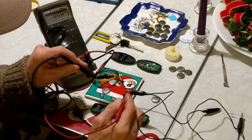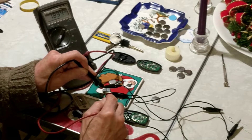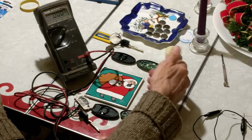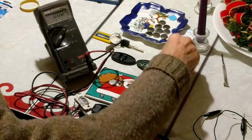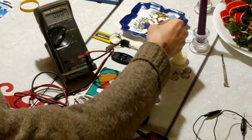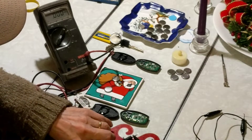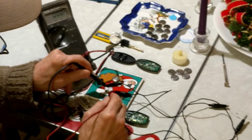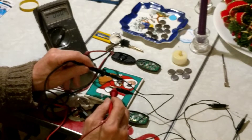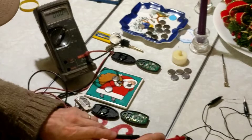I started testing all of them with the load and sorted them. They were all about 3 volts without a load, but here's one that with a load comes all the way down to 1.9 volts. If it was less than 2 volts with that load, I put it in a pile as probably no good — it might still light a lamp, but probably very dimly. I took the one that gave the most reasonable result under load: 2.96 volts. Without the load it was only 3.0 something, so it didn't drop very much — on par with the dealer's new battery.